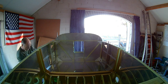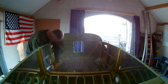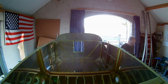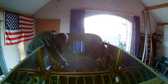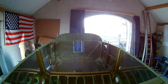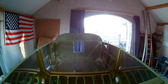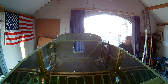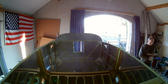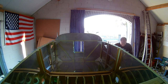Now I'm working on the wingtank attach angle on the outside. There are doublers and stiffeners to mount that attach angle because there will be some weight on there — the front part of the wing is attached to that part. The main part of the wings connects at the main bulkhead, but where I'm working now is where the front part of the wing is attached.